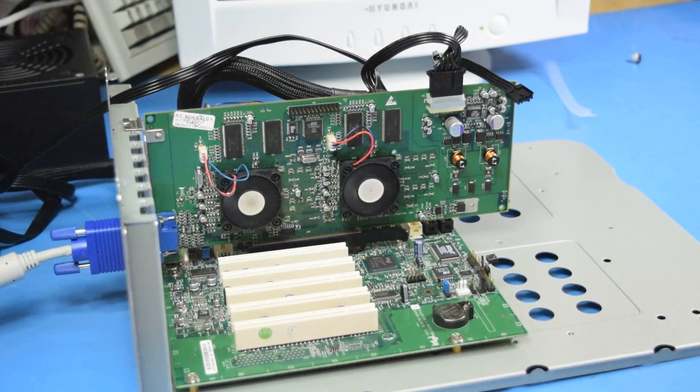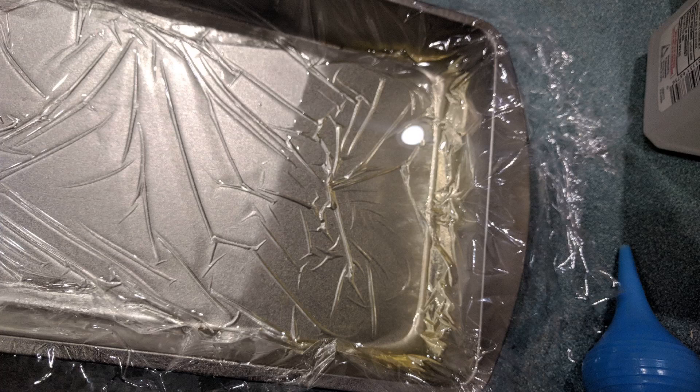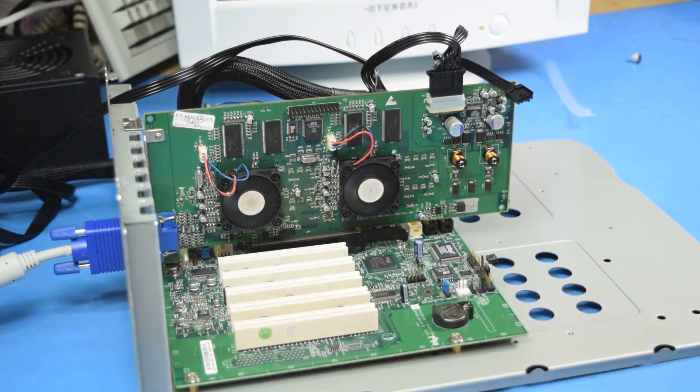I'm still in the middle of recording the new 98 Machine video, so I gotta finish that. But this has been a frustrating interlude, and I hope you guys enjoyed this little look behind the scenes. But wait, there's more! The next day when I went to continue filming, the Voodoo 5 was dead again! I suspect my fears of electrolytic fluid being underneath the BGA chips turned out to be true. So I gave the card a 70% isopropanol bath for two hours, then rinsed it with 91% isopropanol. While letting it dry, I noticed the solution had turned yellow, which made me very optimistic. And lo and behold, after I put it back in the computer, it was fine — and it's still fine nearly a month later. The capacitors were definitely bad, but it also needed to be fully cleaned.